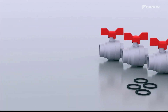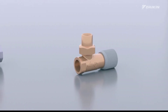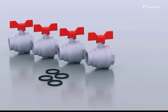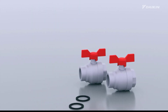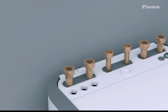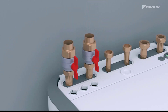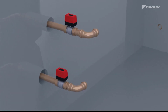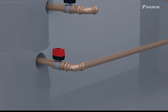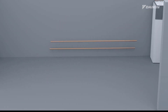To facilitate service and maintenance, we provide four shut-off valves and one differential pressure bypass valve. Use two shut-off valves in the following step, and keep the other valves for the installation of the space heating cooling field piping. Begin by mounting the shut-off valves and O-rings on the water in and out connections from and to the outdoor unit. Then, install the water piping between the outdoor unit inlet and indoor unit outlet, and between the outdoor unit outlet and indoor unit inlet, screwed with one-inch connections.